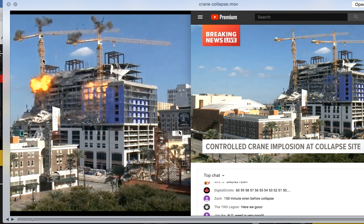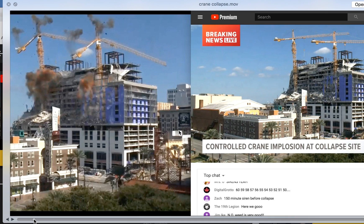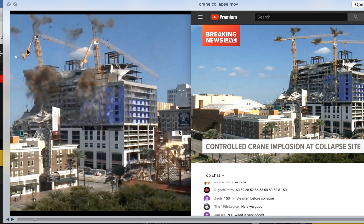So let's watch at what point — they've blown this, so it already has two-directional forces at this point. It's released tension, and whichever out-of-plumb direction it might have been, it's now swinging down like a pendulum. Our explosion is still happening down there, the fireball. Looking at the crane left and seeing what is coming out of plumb — at that point it's coming out of plumb. There's your connected joint steel. This now wants to come straight down — it really doesn't want to go back, but it's already in a swinging pendulum mode because it has a pin, a pinpoint, and that swing. It's still liable to fall down but it can't fall down because it's entangled at the base.